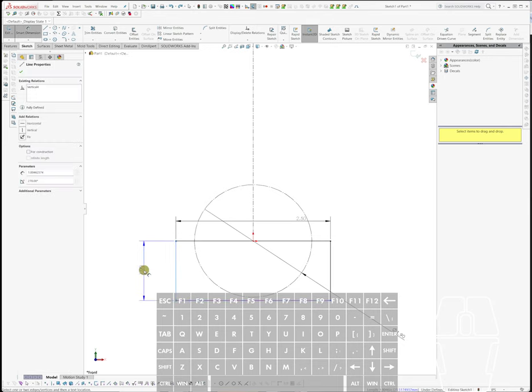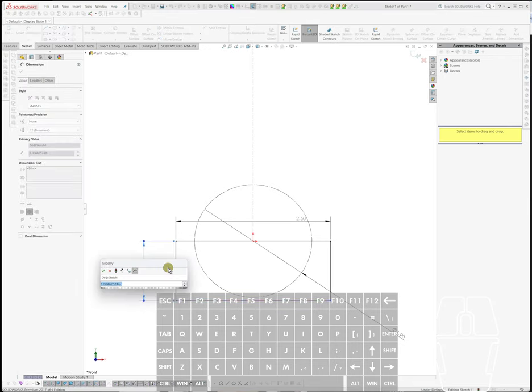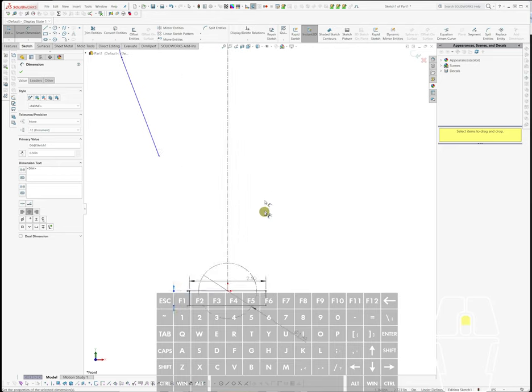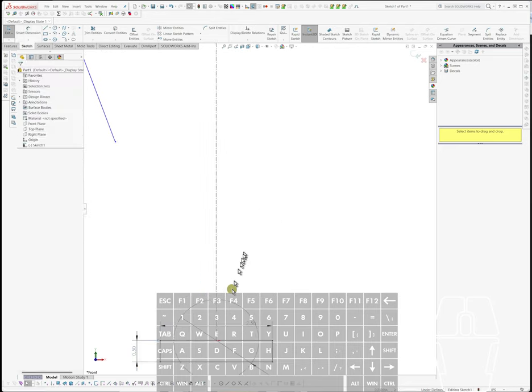All right, so I'm going to make this half inch thick. I just want it plenty thick, that's all. So I think half inch thick of solid, or near solid, maybe 50% infill or something like that, should be nice and strong. Theoretically, I could do some finite element analysis just to figure out where the stresses are, but it's going to be obvious to me where the stresses are going to be, so no sense in doing that.